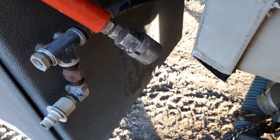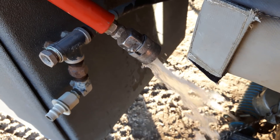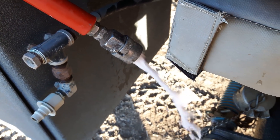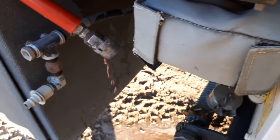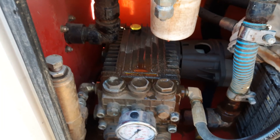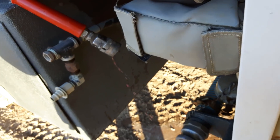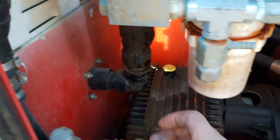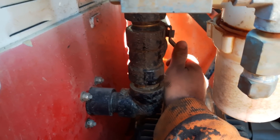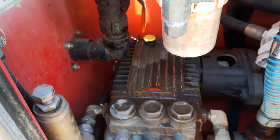Turn the pump off and hang your runner up. Shut it off. Now once you have that, you're good to go. Now it's your choice — some guys like to blow the glycol back out to make sure the system's empty; I'm one of them. But you can leave it in overnight if you choose. If you do leave it in, notice I have some glycol leaking out — there's always a little bit. If you leave it in, turn that off so you're not wasting all your glycol. It also helps in the morning.